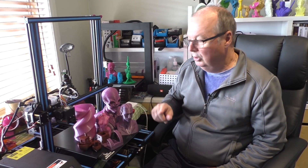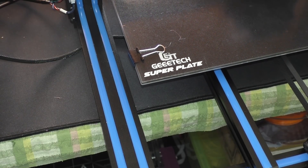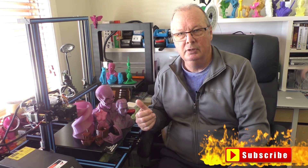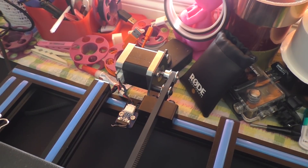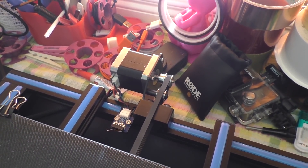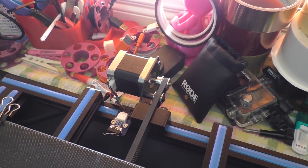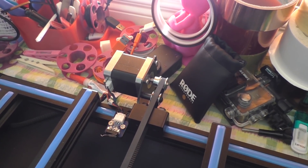Another issue that became apparent very early on was the glass and the aluminium of the bed started separating — whatever glue they used was not adequate — so I had to put clips on the glass bed. There's also an issue widely known on the G-TEC Facebook group: the Y motor gets really hot out of the box. There's a fix for it — you have to go in and change the voltage of the stepper driver for the Y motor, because the preset voltage on the machine was 1.1V when it really should only be about 0.6 to 0.7 volts. I did that and it fixed the issue.